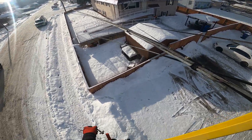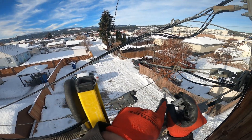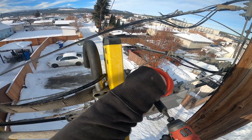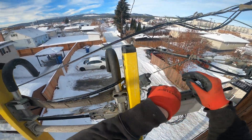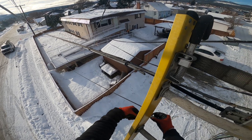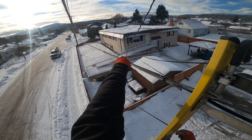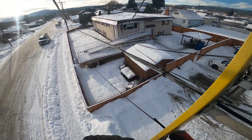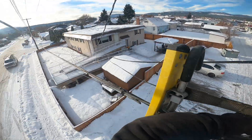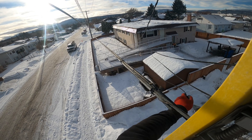And we're back. Now I just have to tension the cable here. That end was facing down because the tension was going in that direction; now the tension is coming from this direction, so we flip it around. You want to keep the clamp loose — you'll see why in a second. On a fresh install to a new home I would come off the mid-span at a 90-degree angle to the home because it looks cleaner, but I'm following the existing lines for this one, which is protocol.